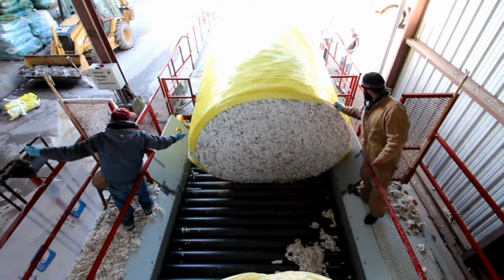Lastly, the operator that has control over the flipper should always make visual contact with the operator on the other side before operating the flipper. This will ensure that he is aware the module is about to be flipped and to be sure he is clear of any moving parts.